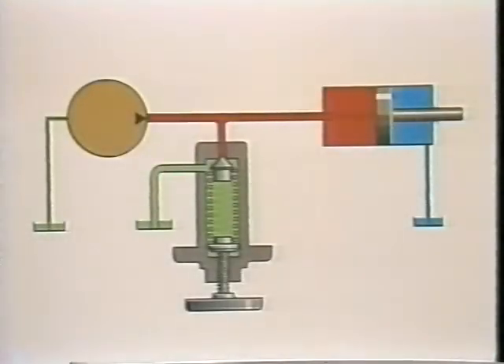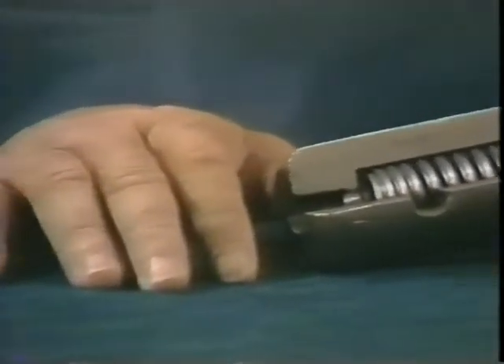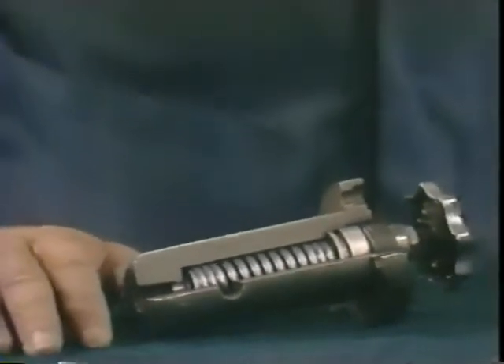When the pressure reaches 1,000 PSI, nothing happens, because the hydraulic force on the poppet is exactly equal to the spring load. Any further increase, no matter how little, unseats the poppet, and a very small quantity of oil begins to flow through. This is called the cracking pressure, because the valve is not yet open enough to pass the full pump delivery. The more oil we push through the valve, the wider our opening must become, and of course the more we must compress the heavy spring, and that in turn is going to take more pressure.